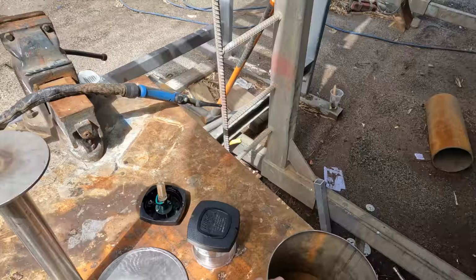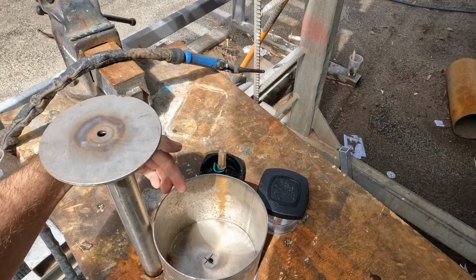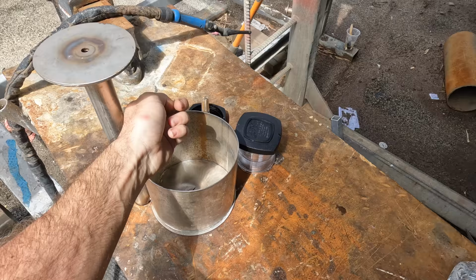The steaming light has this piece of stainless that gets welded over top like that, and it gets cut down here and sort of over this side here roughly, and that allows no light out the back, and then a 225 degree arc out the front. And I will polish the inside up so that it's nice and shiny.